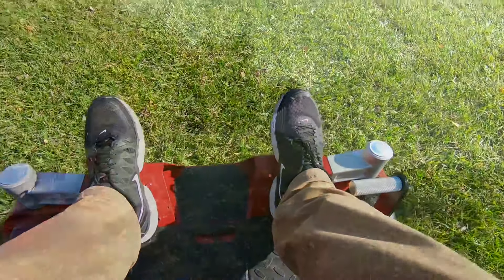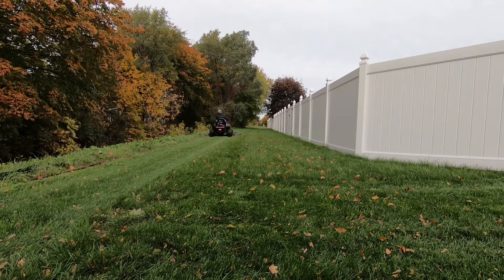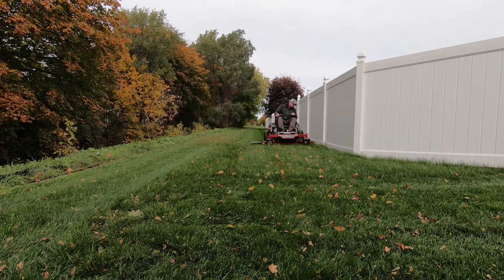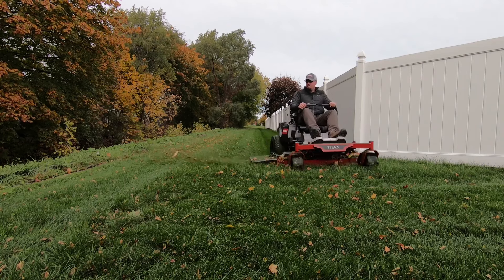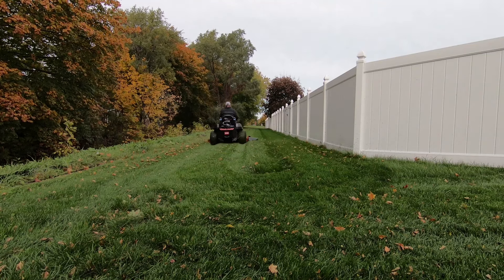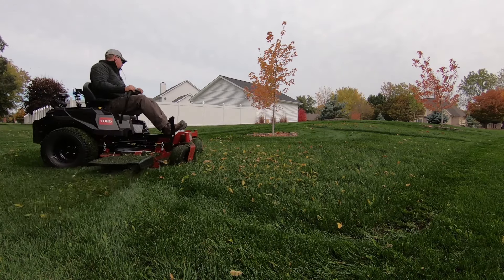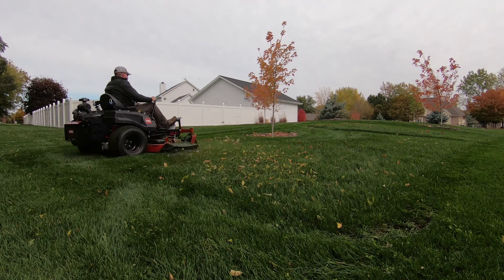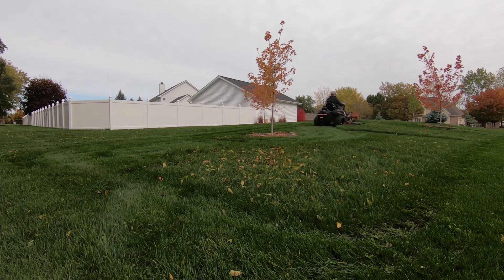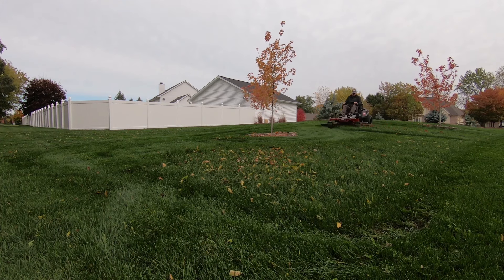We only have a sample size of one of each, so the MyRide was on the Titan and gave it a little more comfort. The blade tip speed on the TimeCutter is 18,330 feet per minute, and on the Titan it's 18,908 feet per minute — so you have a slightly faster blade cutting speed on the Titan, which really helps it rip through nasty lawn. The grass we were cutting was thick, new, and wet, so the Titan was throwing the grass but not giving a perfect cut, and you cannot expect any mower to give a perfect cut in those conditions.